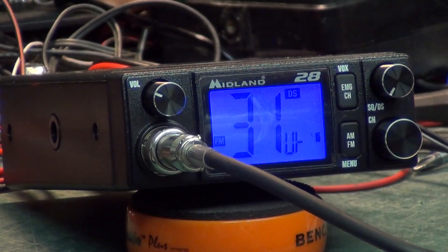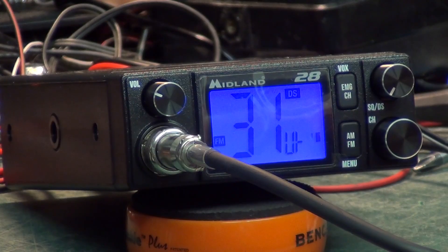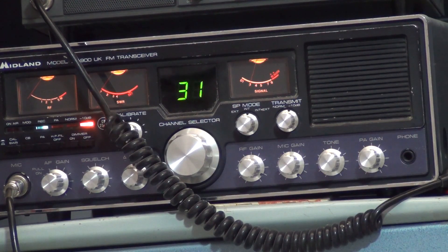So yeah, that worked absolutely fine on receive — figures are great on the test set. Transmit 2.8–2.9 watts, and as I say I can't see any way of adjusting that. Disappointing audio, I think we'll find when I edit this together. I'll go through to our base station — our Midland 76900, from 1982, which has the Cybernet 134 chassis in it — let's see what it sounds like on there. Tango 21, testing the Midland 28, using the factory standard microphone into our Midland 76900 base station. Testing 1, 2, 3, 4, 5 — 5, 4, 3, 2, 1. And that's it — we'll see you in the repair tomorrow. Thanks for watching.